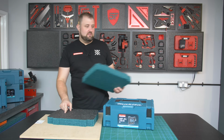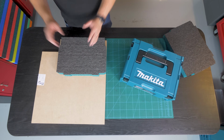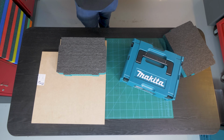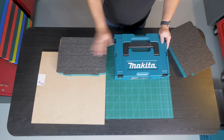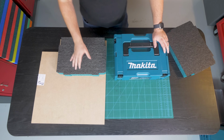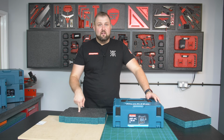So if you're buying a set of inserts, you can actually take one, lay it on your offcut, draw around it, jigsaw that material out, and then it will slot straight in the bottom. We can glue it in and it makes the whole thing feel more sturdy. It doesn't have to be 12mm MDF, it could be a piece of hardboard, maybe some thinner sheet material, maybe some plywood, whatever you've got lying around, glue it in the bottom and it makes it feel better. Let's do one.